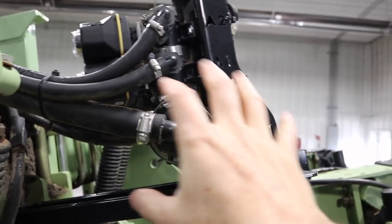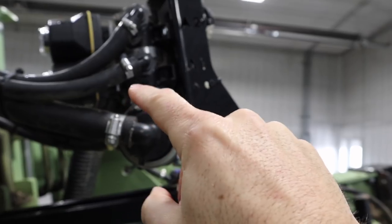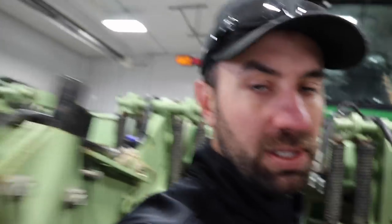This is a liquid shift by Surefire Ag, and this allows us to run multiple rates with this rig. In Nebraska we farm a lot of pivots — circles — and you usually have about four dry land corners on a square quarter. When we get to those corners, we like to drop the rate down. Out here in south central Nebraska, our dry land won't raise a lot because it's a more arid climate. Our soils don't have quite the holding capacity as Iowa or Illinois, so we figure our dry land is about 60% of what production would be on an irrigated part. When we get to those corners, we want to drop that fertilizer rate because we don't want to waste fertilizer.